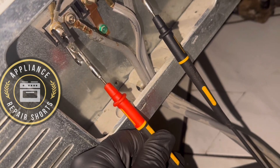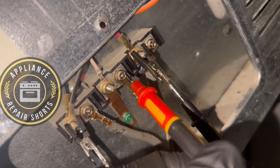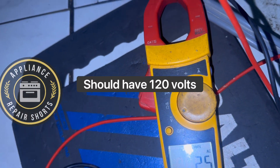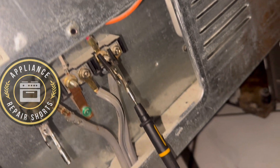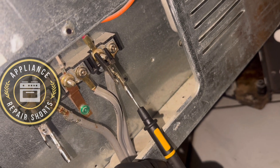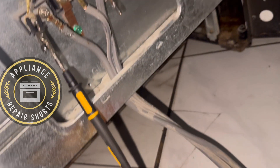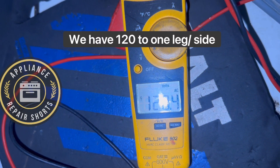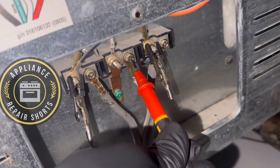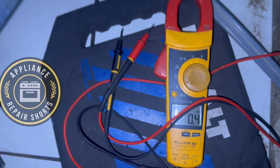From left to right you should get 240 volts around that area. From red to center you should get another 120 — and we don't. From left to center again — these are alligator clips by the way, so be mindful and careful, do not touch them with your bare hand — and we do have 120 there, so that side or leg is good. Just want to show you guys that sometimes it's not your appliance; it could be a circuit breaker. Thanks for watching.